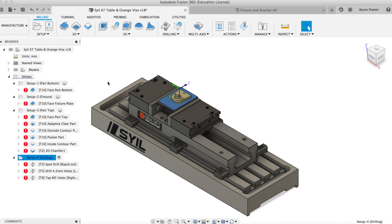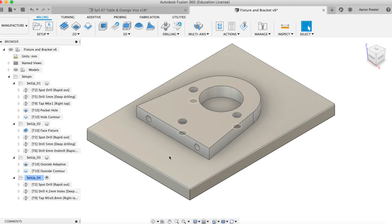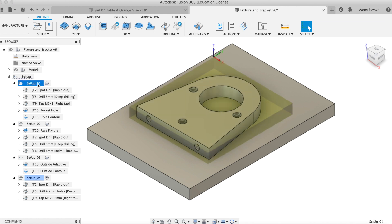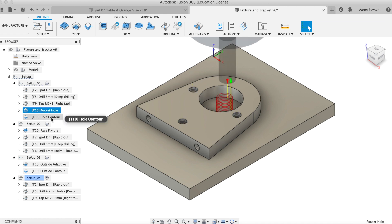As you saw in the video, the super glue let go so I didn't continue down that path. I went back into a modeling environment and just put a couple of holes through the bracket — some tapped holes — and put it on a fixture plate. You can see what I'm doing: I'm spot drilling the top, deep drilling a 5mm hole, coming back in with a rigid tap, pocketing that hole out, and then contouring that hole. I didn't worry about deburring or chamfering — I think Mark can do that offhand on his own. Let's pop on over to the machine and see this in action.